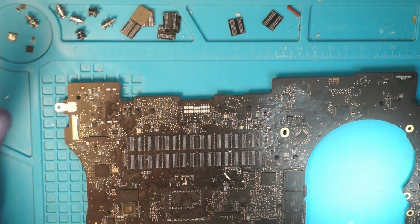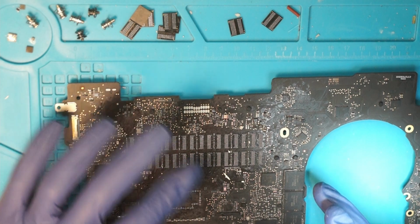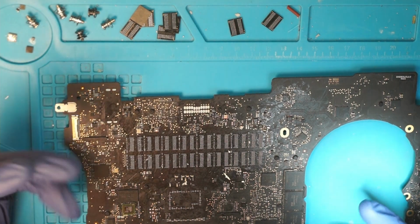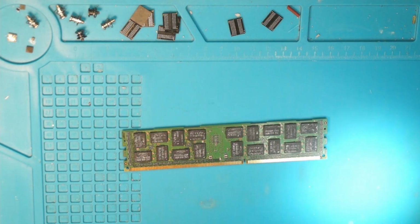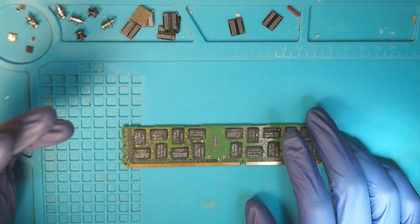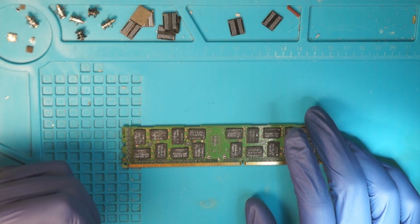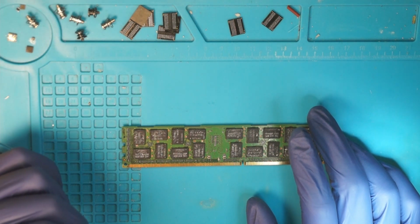So if yours is a little bit less powerful, you can maybe go to 100 or a little bit less, depending on your machine. Same with temperature. That's what I use and what works for me. That doesn't need to work for you, nor is my 420 degrees C necessarily accurate. There is error in it, let's put it that way. If you start from a memory stick, you definitely want to use less airflow and also less temperature. So I'd say 80, 90 liters of airflow and 380, 370 degrees Celsius.